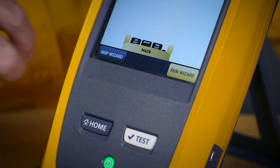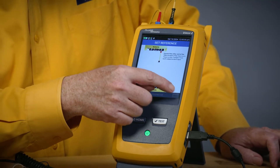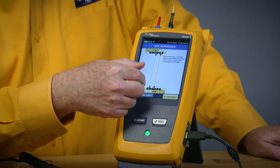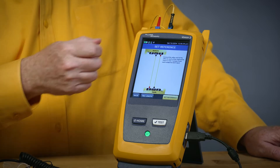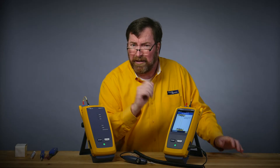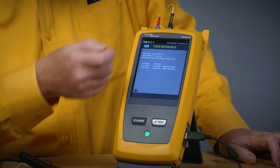One of the things I really like about the CertiFiber Pro is when I go into set reference, I have a wizard to walk me through the steps. So let's jump a couple steps in here — we'll see black boot in the power meter, red boot going to the output port. It even has yellow fiber to remind us that we're doing single mode, so we remember to plug into the single mode output and not the multi-mode. Next we'll say set reference. The nice thing about the wizard is if the reference is wrong, the tester will tell you there's not enough light. We can view the reference at about minus 3 dBm — that's what we're looking for.